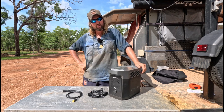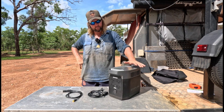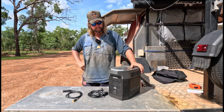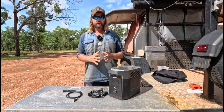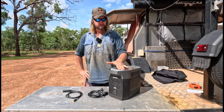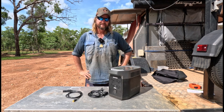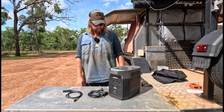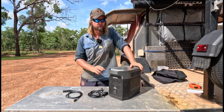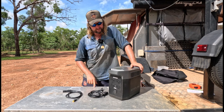Over time I was dropping the unit more and more because it just wasn't getting fully charged enough via the one panel. I would definitely go for the max input — 400 watts or 65 volts. As long as you don't exceed the voltage you're fine. If you have more solar it doesn't matter — after 10 amps it just can't do anything with it. It does have a built-in solar regulator, so you can run unregulated panels straight into it.